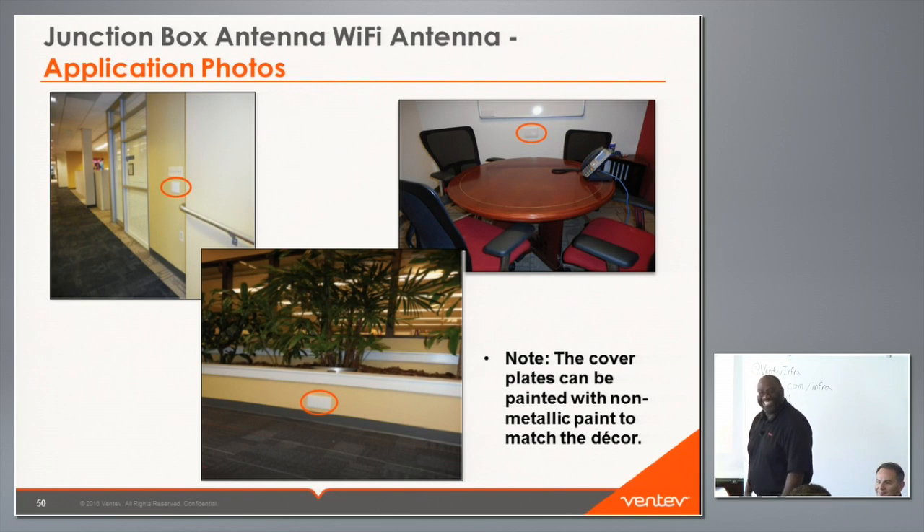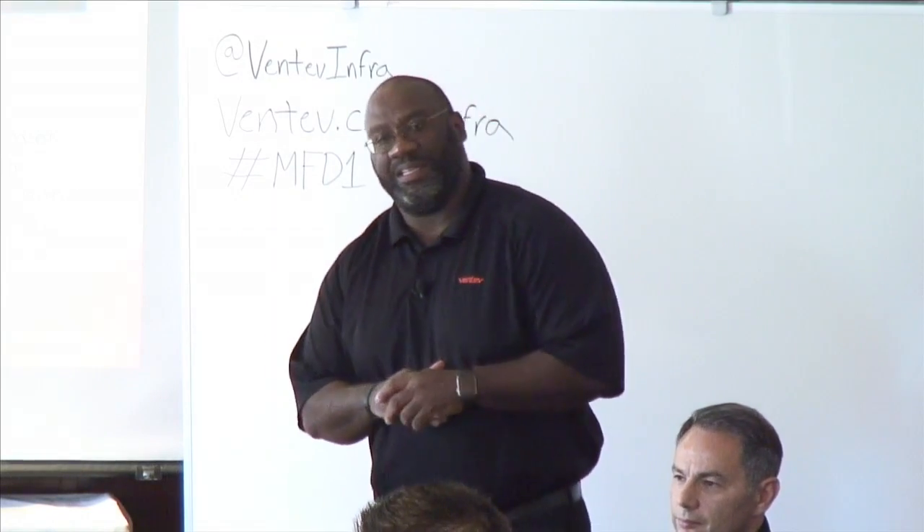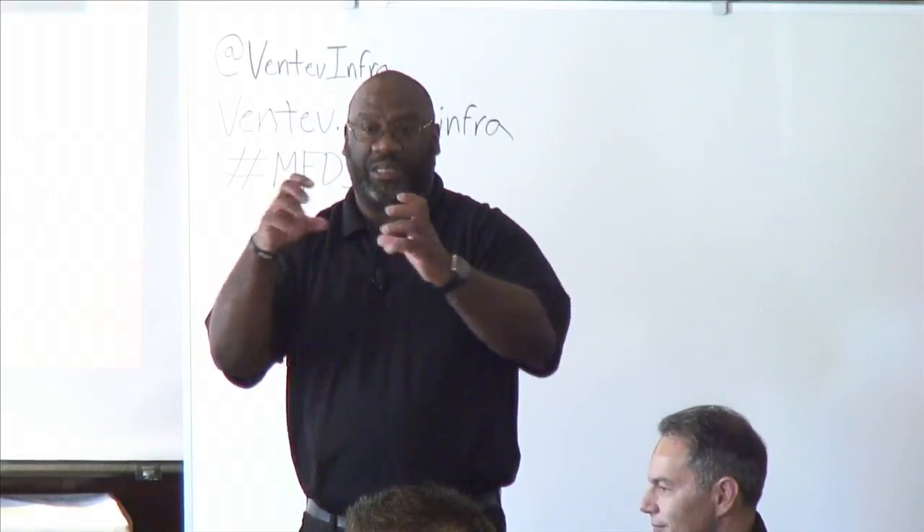The unit is just the antenna — there's no AP body visible. An audience member asked if you can use any standard triple-gang blank cover plate from a hardware store, such as black or stainless steel. Dennis confirmed the hole dimensions are standard gang box dimensions, though stainless steel is not recommended. These are old-work boxes. For new construction, you could transplant the antenna elements into a new-work box, though you'd need to cut the articulation arcs and make appropriate modifications.